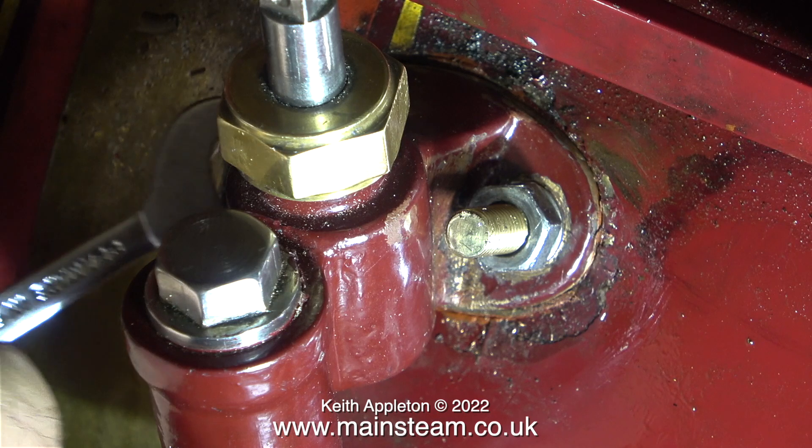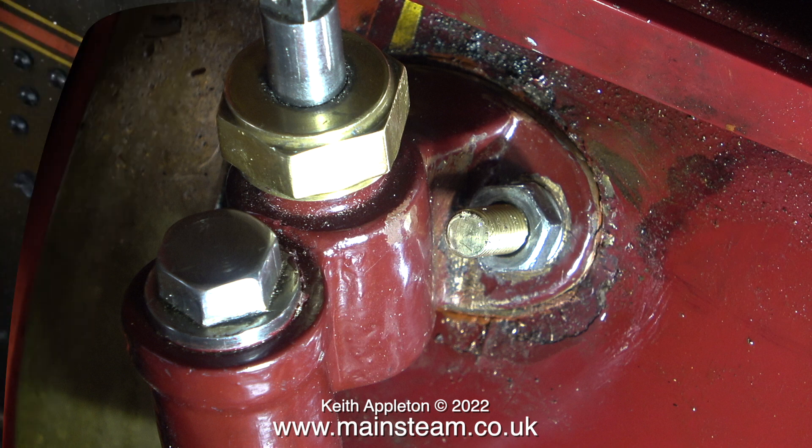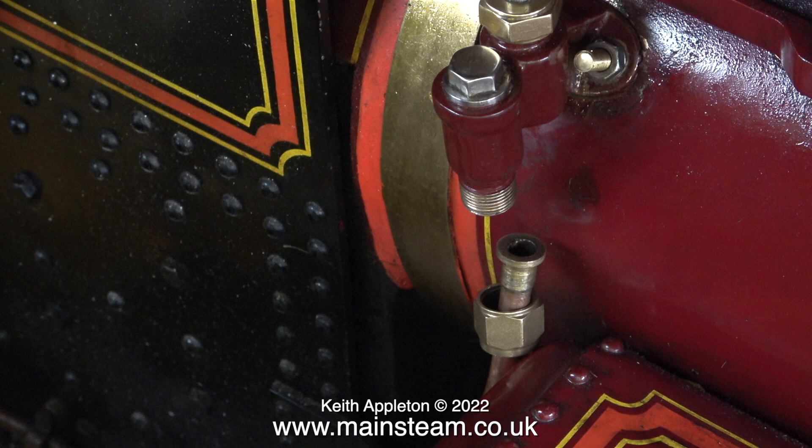This is a test fit of the check valve to make sure it sits okay on the boiler. Once I'm certain that everything fits okay I will remove the check valve, make a new gasket and refit it. Then all I will need to do is refit the pipe from the injector to the check valve — and honestly this is not an easy job. When I replace the original injector complete with its secondary check valve, I'm going to connect the pipe to the injector end first. That should give it a bit of support underneath the engine, and once I've done that I will then try and convince the check valve that it needs to accept the pipe at this end. I really have struggled with this job because I've had very bad sciatica, but now that's mended I'm not in pain anymore so the job has become a little bit easier.